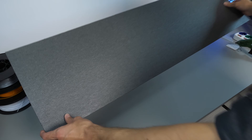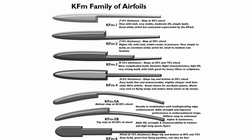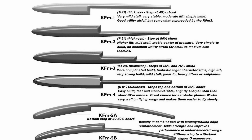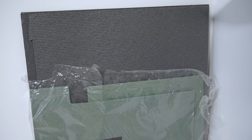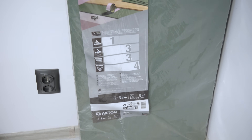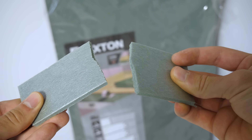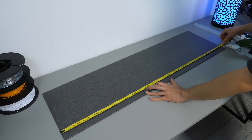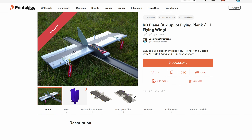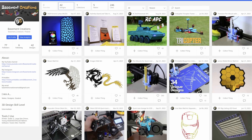Now that we have the right software, it's a good time to actually build this plane. The specific airfoil profile I chose is KF M3, because it offers 'fantastic flight characteristics.' The main material I'll be using is 5mm XPS foam sheets, which you can probably get in most DIY stores as floor underlay. I'm going to let the build montage play now — if you want to follow along and make this plane yourself, check out my Printables and Thingiverse profiles for detailed build plans.